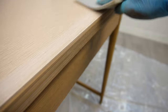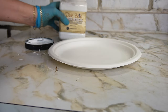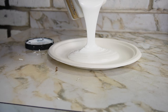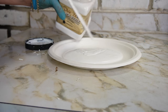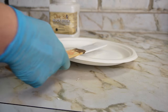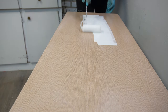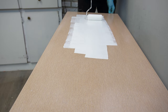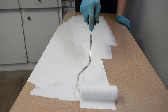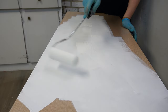Now to recreate a different top: I used an 80-grit sanding sponge and removed some of the wash that had spilled over onto the laminate top. Then I poured some Slick Stick primer onto a paper plate. Slick Stick is amazing for any slick surfaces — plastic, glass, laminate, Formica, or anything with a really slick surface including metals. If you prime with Slick Stick it creates a bond to the slick surface and a bond for your paint to stick to. I applied a first coat using a four-inch roller.